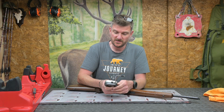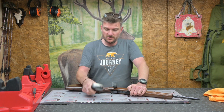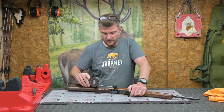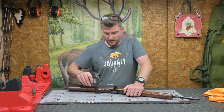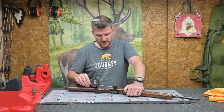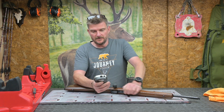So it's now 2 lb 3.9 oz, which is 1,017 grams. Let's give it another one just for a bit of a look. 999 grams, third attempt. These gauges are quite critical of how fast you pull them, so you need to put them on very gently and then just ease them slowly in tension.